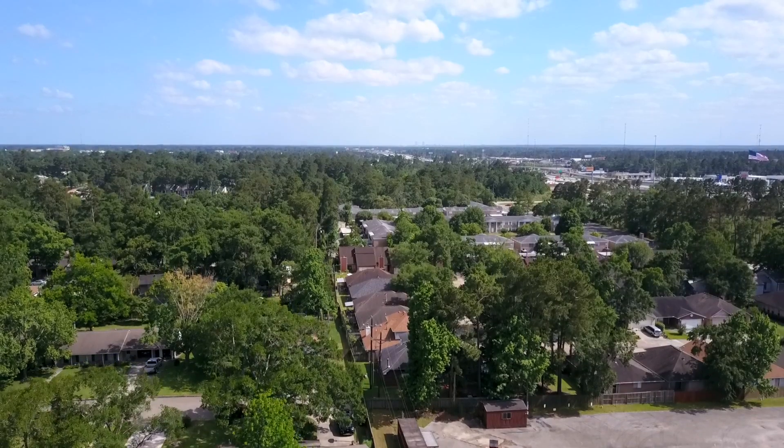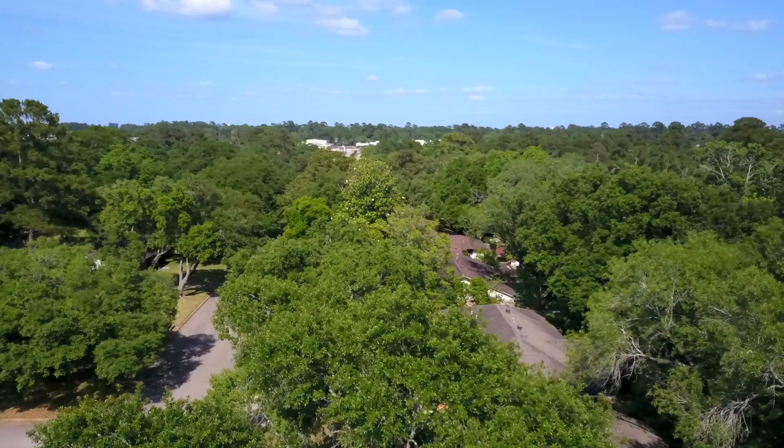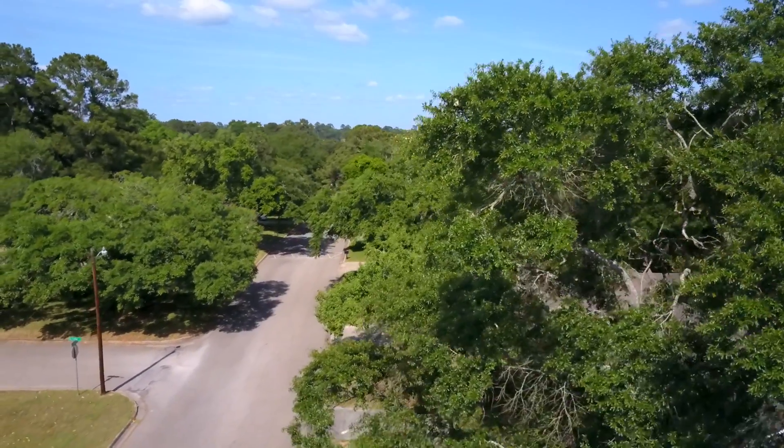Not only is this one having issues with the horizon tilt, but either I'm losing my mind or the camera is not focusing properly. Off in the top left side of the screen in the distance, everything seems to be fuzzy — no matter what settings I put it on. As soon as it moves around a little bit, everything's blurred out and I'm constantly having to try to tap to refocus. We're going to go ahead and redo the IMU.